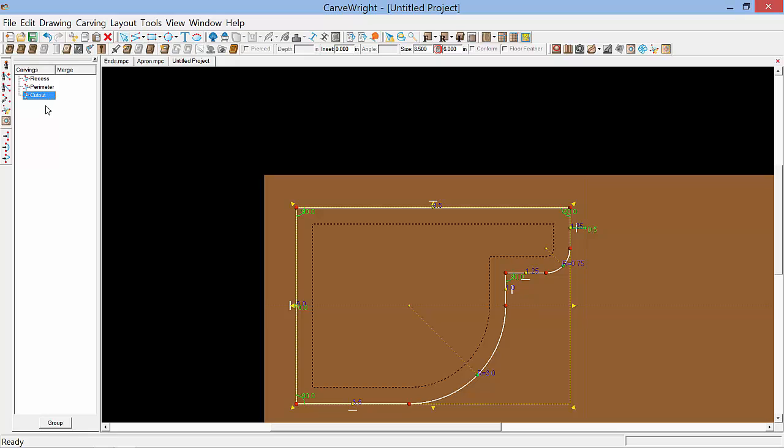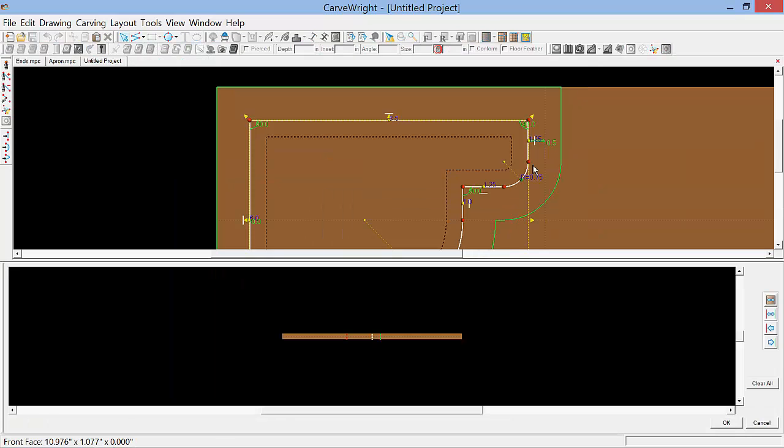So we'll reselect our perimeter, and we're going to make that profile, or that sweep that goes all the way around, that rounds over the edge. Again, this is a closed path, and we're going to use the sweep corner tool. Mine is set for sweep rounded, so I'll use the pull down to set sweep corner, then click on the tool.